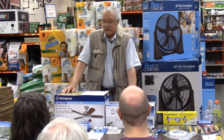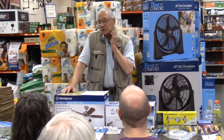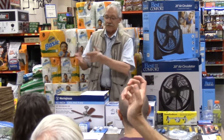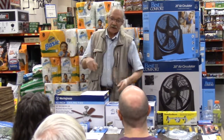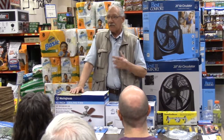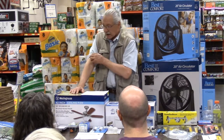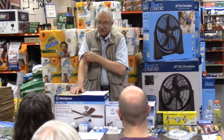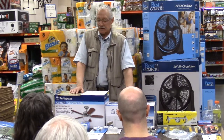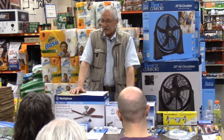But you can literally, before you put the fan blades on, test the motor to make sure it works and there's nothing wrong with it. Just by hooking up the wires, plugging it in and turning the fan on, the motor will spin. If there are no blades on the fan, you probably cannot discern the different speeds other than low and high. Medium probably, because there's no load on the motor at that point, so it's kind of hard to discern. You're just looking to make sure it turns, and make sure the bearings aren't making any noise at that point.